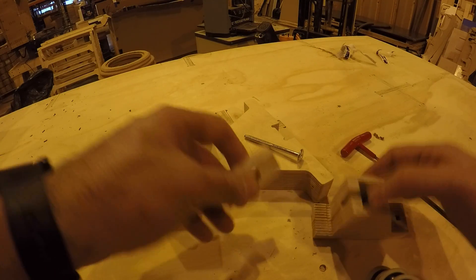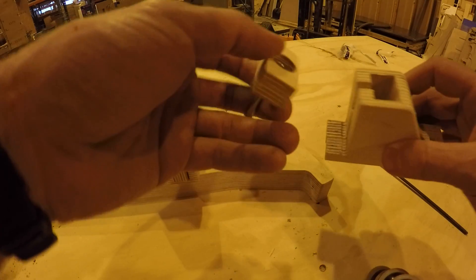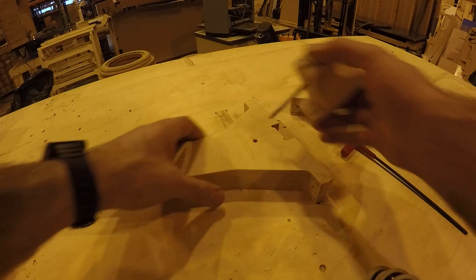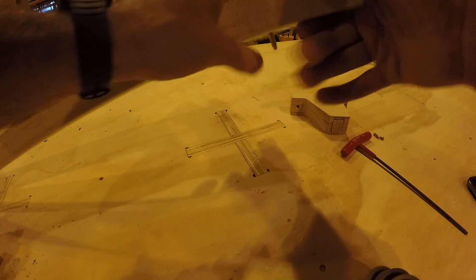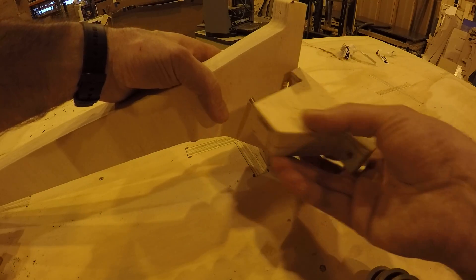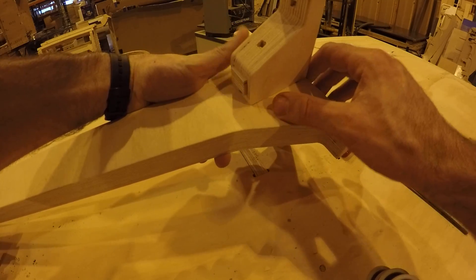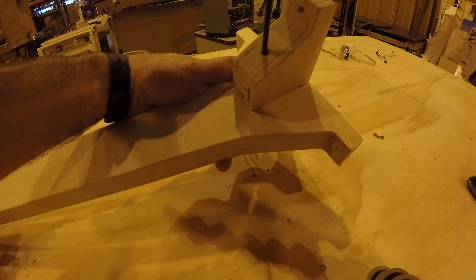This one here — I'm going to take the bolt, put it through like that, and install it here. You can see there's a little slot that allows the bolt to go through. Then on our leg, we take this and install it through, and the bolt pops out like that. This is the side with our T-nut, so we put this on here. I've made a couple of pockets that create a nearly hidden hole for our wrench to go in, and we tighten this up like this.